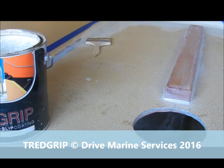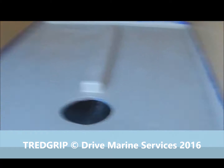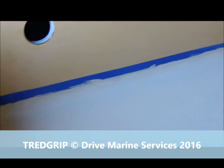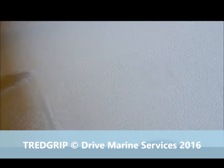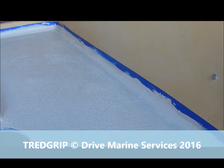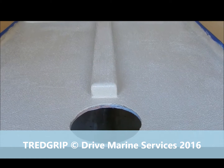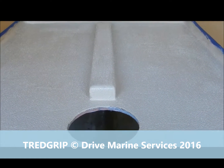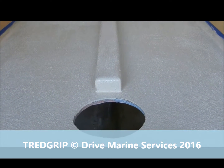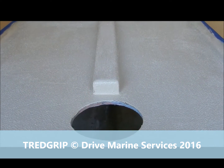We're going to go for three coats on this, but today I'll get a coat on, let it dry overnight, and then two more coats will go on tomorrow. First coat of tread grip applied — looks a million dollars already. We'll put a total of three coats on before we finish. You should leave at least three hours between coats. It's about four in the afternoon now, so we're going to leave this until tomorrow morning. If a coat goes on tomorrow morning before about ten, we'll put the next coat on by about one or two o'clock in the afternoon. Then all we need to do is cut around the edge at the bottom of the masking tape before we pull it off.